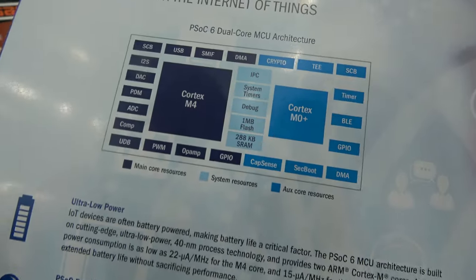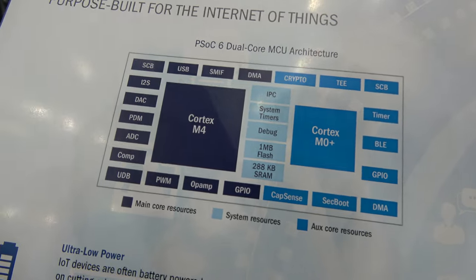First and foremost we consider power. We have industry-leading power numbers on an ultra-low-power process and the ability to do dynamic voltage frequency scaling, so you can determine what frequency you want to run each core and what voltage that frequency needs in order to save power. We also added a dedicated M0 Plus core to do low-power housekeeping functions and implement state-of-the-art security for this product.